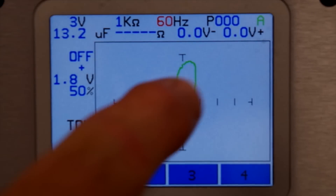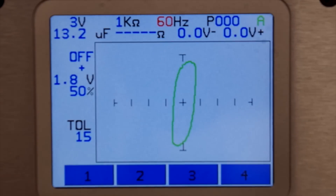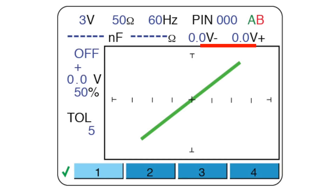Touching the Tracker 3200S display makes it easy to switch between full screen and power-up screen modes. Displayed in the power-up screen are sig assist values such as semiconductor voltage breakdown, capacitive value, and resistive value. Also displayed are the tracker channel, scanner pin number, selected range parameters, and pulse generator settings.